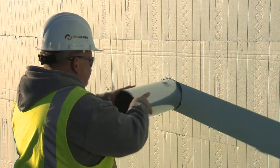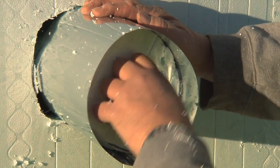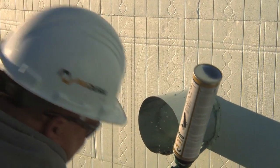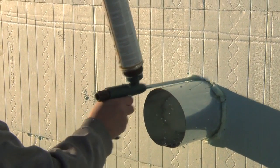For dryer ducts or more flexible sleeves, consider fitting the cut plugs of the EPS inside the sleeve to provide additional form support to the concrete during placement. These can be removed later after the concrete is cured as part of the installer's final strip and clean up.